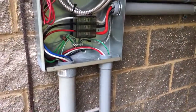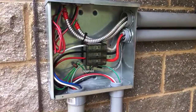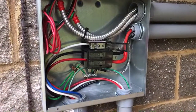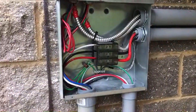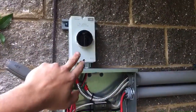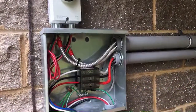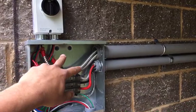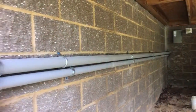This second pull box has another PDB — we're using it to transition between a large number-two SER cable and copper. That's a great way to transition when you have really big wires where wire nuts won't work anymore. A PDB is about 20 bucks and mounts right in the box. We also have a disconnect for the solar so they can disconnect it at the house — like a common-sense rapid shutdown. Then we transition into MC cable with anti-short bushings.